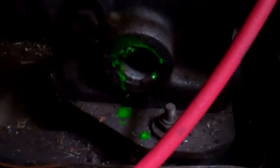Look how that is — it's all the way down. I could just hear something else hissing away. That was the first thing I checked: the compressor sight glasses. The O-rings dry out when they start leaking. There you go — that's leaking as well. Two for the price of one.